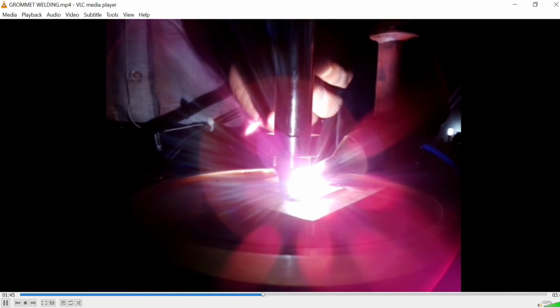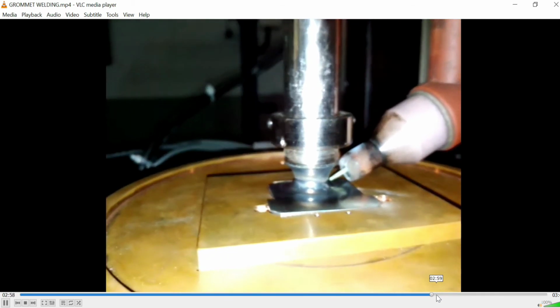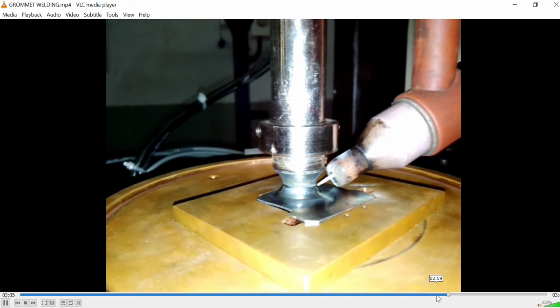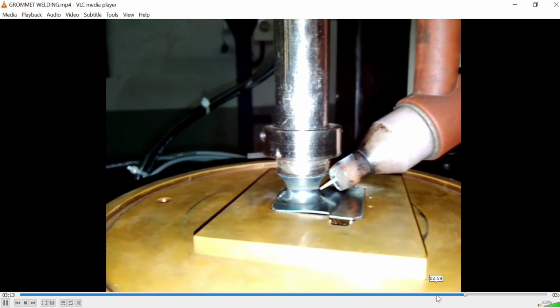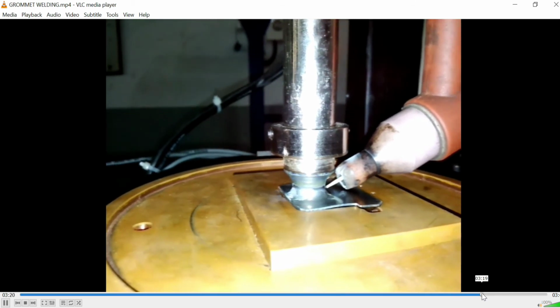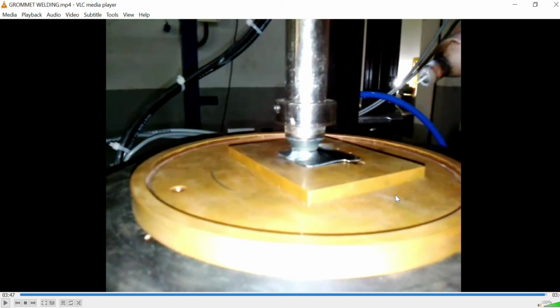What you might not see clearly here is the wire feeding process, which is also required. To have a 3 to 5 mm bead for such a small component, or a 2 to 3 mm bead also, we have given a 0.5 mm feed rate of wire which just drips. So here you can clearly see how the weld bead looks. It's a very clean weld with the proper curvature, feed rate at about 0.5 mm per second to about 1 mm per second. Basically the wire we've used here is 0.8. The front lip intact, that's the criteria during all our welds, because the front end tip has about 3 mm space where it ruptures due to heat.